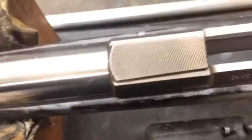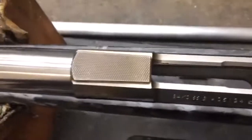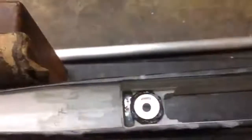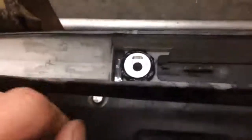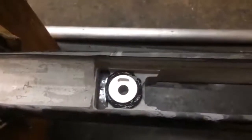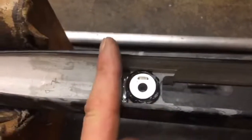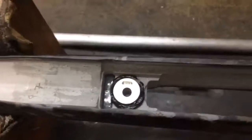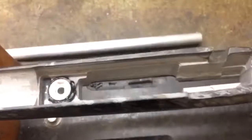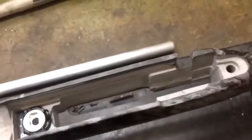So now we can fit the rifle into the stock, and it's got a real recoil lug management system around this front stock bolt. So the next thing to do is obviously to bed the gun down now into this new recoil management socket, if you like. So we'll clean out that old MarineTex bedding, and then we'll bed from the front of the action back to the magazine well, and we'll bed the tang area, and then he should have a reasonably consistent bedding job on his rifle stock.